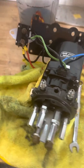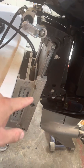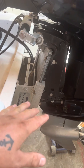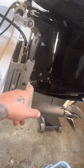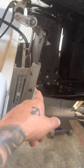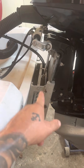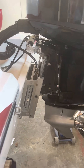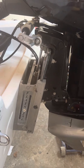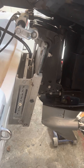I've already put the pump back onto the boat. The motor does lift up all the way by itself and all the way down — it's just still a little slow. What I'm going to do is adjust this so it should throw about 300 PSI to these hydraulic lines to shoot the ram up a little bit faster than before, because before it was very slow and it almost seemed like the pump was burnt out and not working.